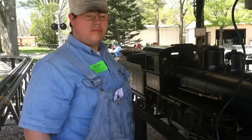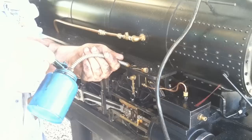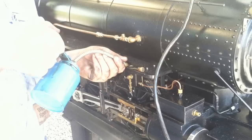Equally important is keeping the cylinders lubricated. When you lubricate the cylinders, you fill this black box right here — you use a heavier oil, a high-temperature steam oil, and you just fill the box. This is called a mechanical lubricator. As the engine moves, it moves the actions through here and pumps oil on both sides and into the cylinders to keep them lubricated. If they were not kept lubricated, they could get hot, stick, and eventually require the cylinder to be completely replaced.